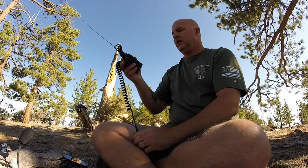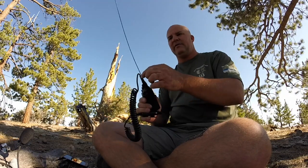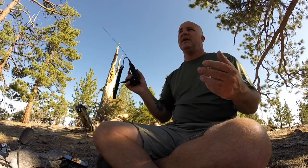If you feel you need to, like if it's sitting on the ground, you can always take and hold this thing up above your head when you think the signal is getting ready to go out, or just stand up a little — give a little more elevation off the ground, it can help. Of course I'm just running a little SMA 17-inch small whip antenna on this thing and it hasn't let me down yet. But if you're really deep in the Sierras and far away from repeaters you might need to throw something up in the tree, whether it be a little J-pole or run some kind of VHF Yagi antenna like the Arrow beam. I've got one of those — you can vertically polarize it on a tripod and get a beam out there further; ideally you'd know which way to point it though.